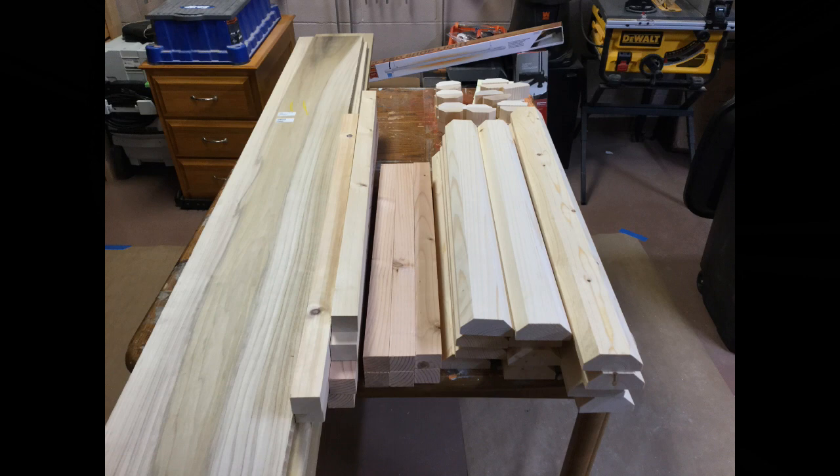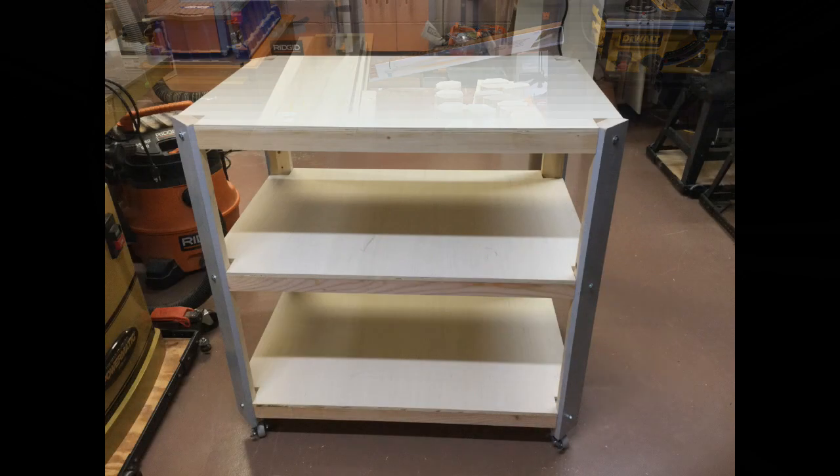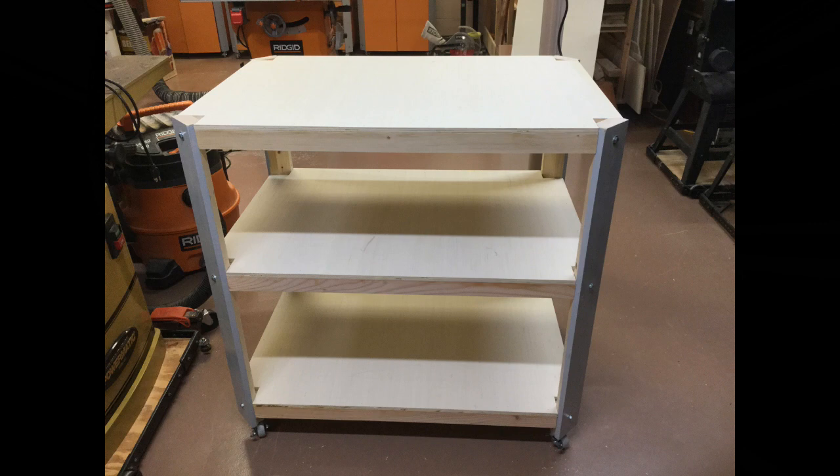For example, you've got an eight-foot-long piece of two-by-four and you cut the corners off. Then let's say you're making a four-foot-tall cabinet — you cut the posts at four feet, but you're going to have extra stock leftover. You're going to cut those up into roughly one-and-a-quarter-inch-thick wedges, or salami slices. You're going to need four of them for each shelf, each piece of plywood that's going to go inside the cabinet. I recommend a minimum of three pieces of plywood — a top, bottom, and somewhere in the middle — so that the cabinet is nice and rigid.